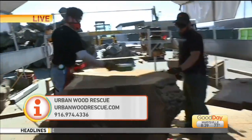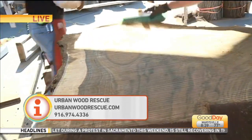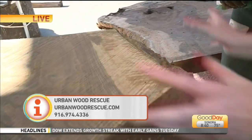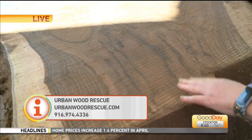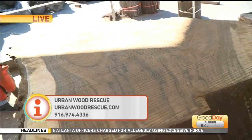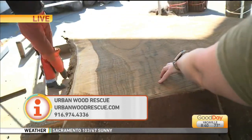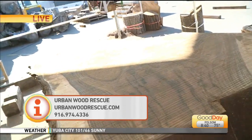Let's walk over here and look at this. This is a black walnut tree that they just milled and sliced through. Jen, can you tell me a little bit about the pattern we're seeing? Sure. On the outside you're seeing the sapwood, which is the outside of the tree. Here in the middle is the heartwood, and you're seeing a lot of the black color from the black walnut as well as the figure that runs up through the log. If we ran water over this, you would see really shiny black here and then a blonder color here. This tree is pretty amazing in that it has such a large heartwood, which will make a really nice table or piece for somebody.